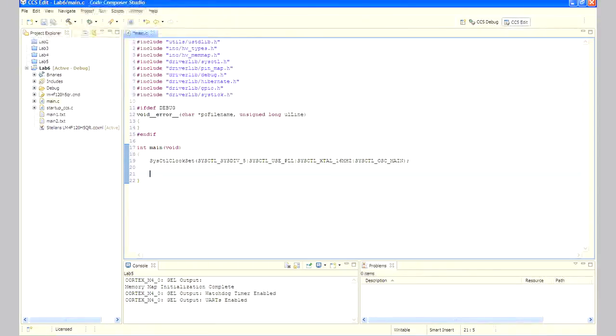Add a line for spacing and add these lines of code after the last. You should recognize that this is enabling the port F peripheral, changing the pin type for all 3 of the output pins to output, and then writing an 8 to GPIO pin 3. That means that single one will light that green LED.